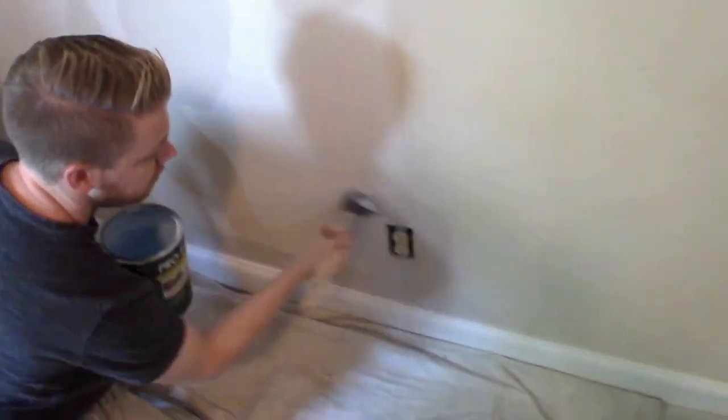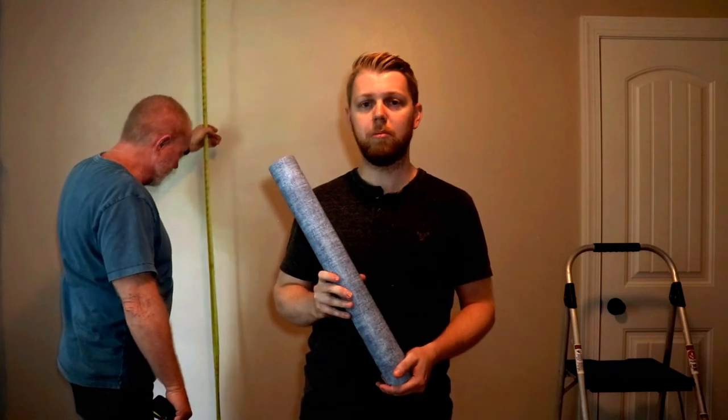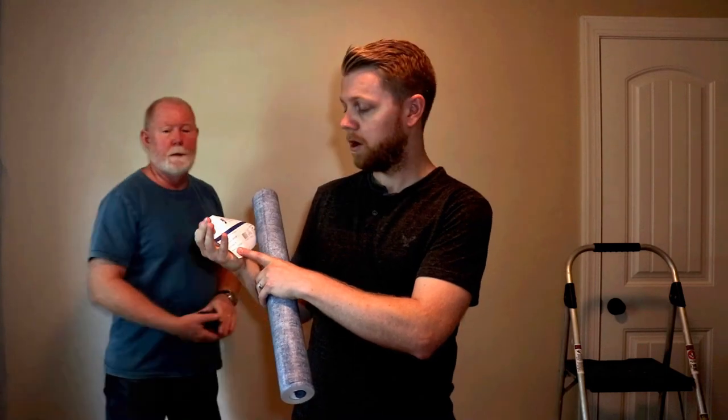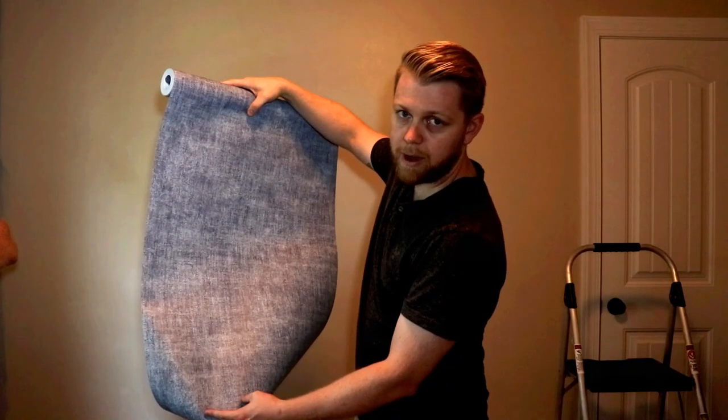It's a low odor so it's not going to stink up the whole house. There are all sorts of places you can get your wallpaper. We got ours at a local interior decorating store called Pops Incorporated in Winston-Salem. On the wrapper for the wallpaper it gives you the pattern number and the batch number so you can make sure your print matches — it'll actually be slightly different in color between batches, so you want to make sure you have all the same lot number. It also explains the design repeat measurement.